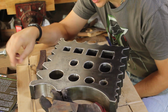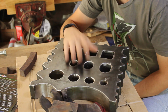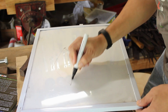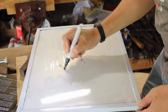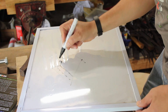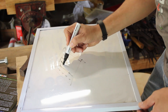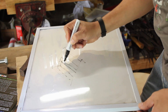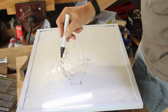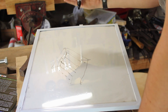So, as part of getting this thing ready to use, because this is putting the cart before the horse, I need to build a stand for it. So, let's get on with that. What we're going for is an angle iron frame, which will have a 75mm channel at the bottom, so cut out in the middle so that you can drop the swage block down into it so it can stand upright and be supported.